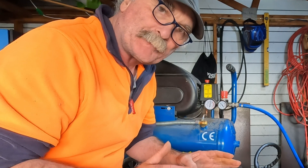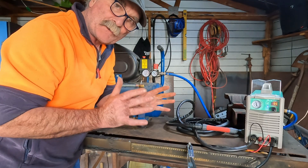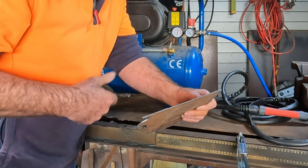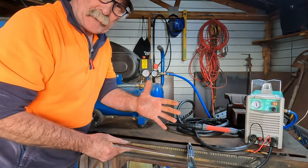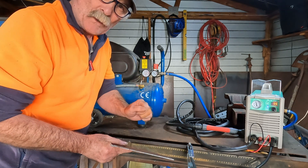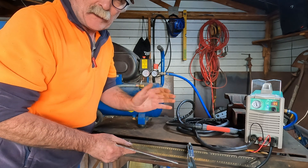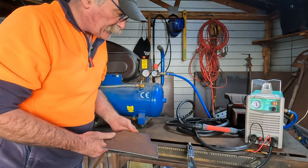Now guys, I wouldn't really expect much out of this little air compressor here, but it just depends what you want to use your plasma cutter for. If you're looking at cutting something like this — just 3mm plate — it's still quite thick and you can still manufacture stuff out of it, like trailers and that sort of stuff. But if you want to go quite thick, then you're going to have real issues with this. But if you only want to cut off bolts or other bits and pieces — only the light work — I think you might be able to get away with it. Anyway, I haven't tried it on this machine, so let's have a go.